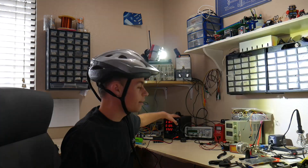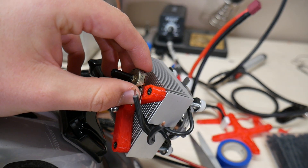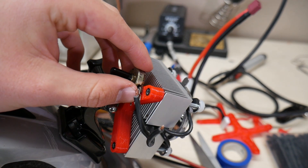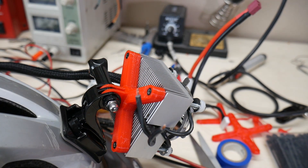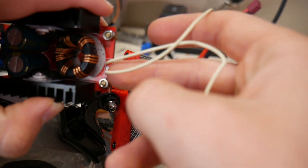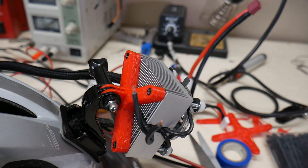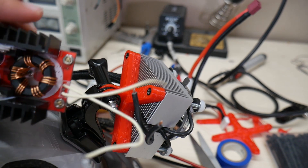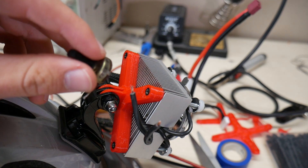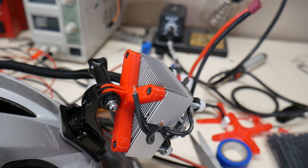Now to control the power of this LED — how bright it is — I'm going to be mounting this potentiometer on here. This potentiometer is going to be connected through these two wires back in the harness to my boost converter. I just desoldered the small potentiometer that was already on it and put two wires coming out where the potentiometer used to be. I'm going to have these going through the wire harness to this new potentiometer. This boost converter's max output voltage with that potentiometer in place is around 32.68 volts, which is perfect — it's perfectly bright then. And the max voltage of this LED chip is 34 volts. Let's glue this on and solder it together. Now that this is in place, it'll be easy to reach up and change the brightness of the LED.